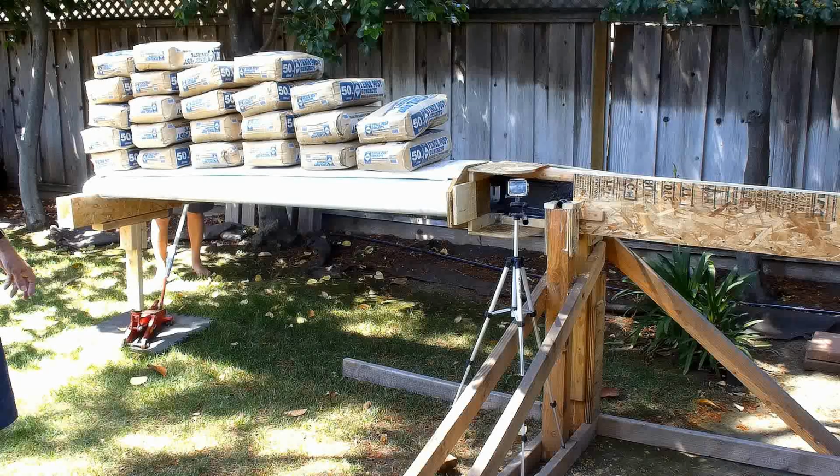So let's go back and take a look at what that wonderful GoPro camera captured and see the actual frame-by-frame failure of the test fixture. You'll see the upper 2x4 and spar cap peel away from the attachment fitting, which begins the failure mode. Happens very fast. It lasts for 2 or 3 frames. And let's take a look at that.